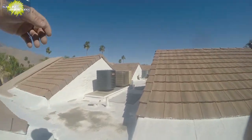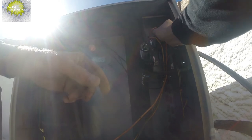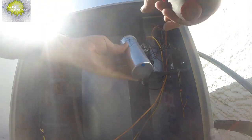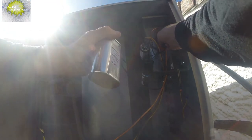We'll go through afterwards and take all the trash out — pile it up and jam through them all, then come back and get it all out. Now we're going to change this. If it's a 40 it's still good; I can use it somewhere else. There's our jumper for the common from the fan. It's a 40/5 — so it's actually good, it's just the wrong size for this compressor. Now we're going to plug in all our commons. We'll probably need to loosen the strap — it's really tight there.